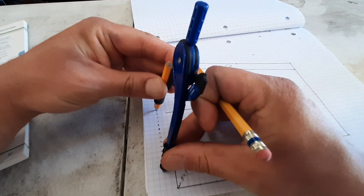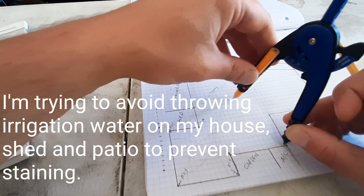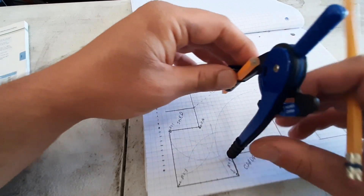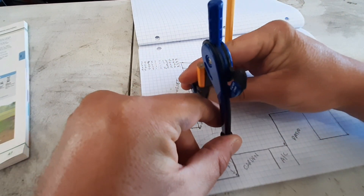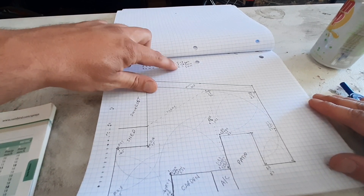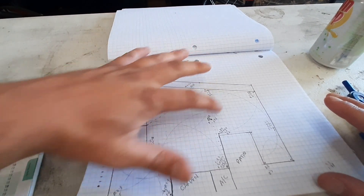I'm going to look at 30 feet for this one, but that was going to throw all over the patio, so let's adjust. Yeah, that looks nice. I'm going to back it down when that time comes in real life. Voila! Here's the finished project — for the backyard at least. I've got my zone totals up here. All of them are under eight GPM and it's going to be three zones. The only thing that's a bit unusual is I've got one zone where I'm just going to put a big nozzle and let it handle the shade area, and I probably won't run it as long.